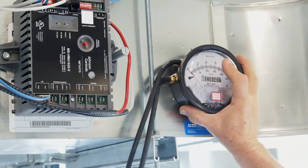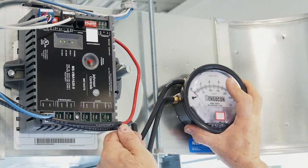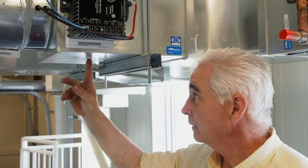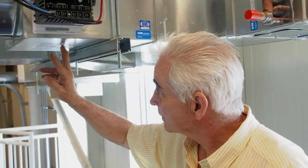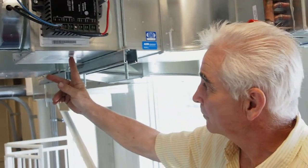As TAB technicians, we should be able to measure in parallel with the building management system what differential pressure is occurring. There should be T's here — there's not T's. From that differential we can look at the calibration chart on the bottom of the unit: a six-inch box with a differential of 0.25 is 275 CFM. We measure the differential, know what size box, look at the calibration chart — that tells us the CFM. We normally calibrate the box for the maximum and minimum to make sure the balancer has the right numbers.